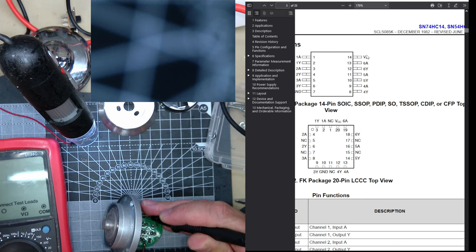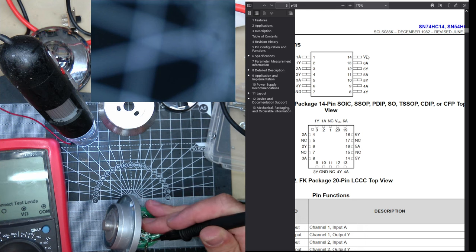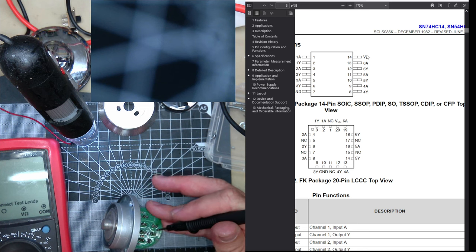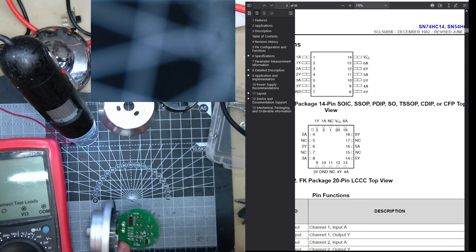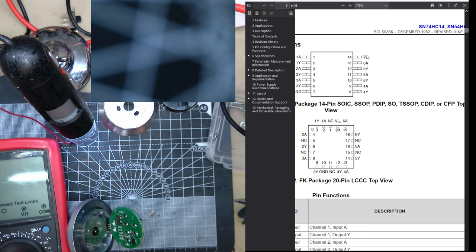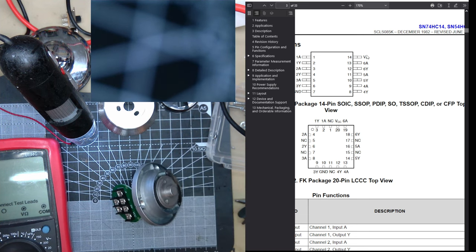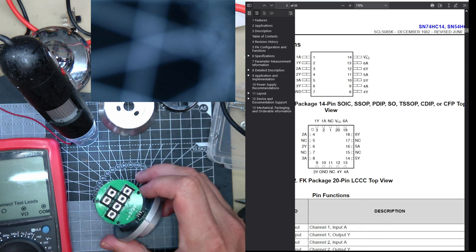Huh. So the chip runs straight off the regulator and so do the LEDs. But why would it blow up then if I put 12 volts into it? It's running hot because when I run it, it consumes. So maybe a good way of diagnosing is to power it and feel what gets hot.